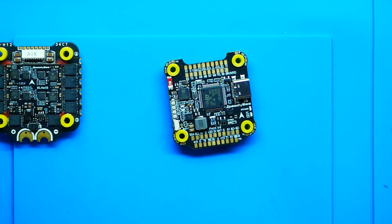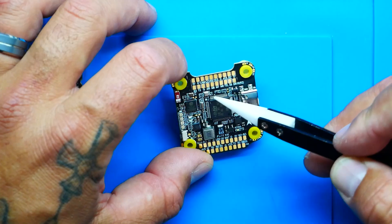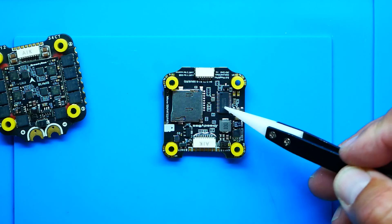Right here is the full Bluetooth setup — the connector antenna — which is what makes Speedy B special. They've also been adding a four-LED bar that reads the incoming voltage and lights up one through four LEDs, so you can just glance at the flight controller and know if the battery is charged. Even on this newer F405 55-amp stack at $70 you still get that. There's plug-and-play DJI right on board, built-in OSD via Betaflight if you need it, and an SD card slot. Previously there were issues with certain micro SD cards not working with Speedy B — that's been solved and they'll all work beautifully.